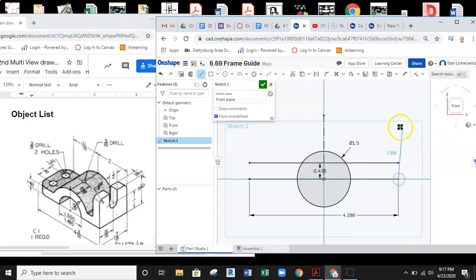Now I can go ahead and start working on the height of this part. So I'm looking at this over here, this height. You're looking at 1 5/8. So we're going to come straight up. Whoop, mouse is moving on me. 1 5/8, so type in 1, again, plus, oh, I can't do that. There's old habits with Inventor. Got to go ahead and just click first, then I got to put a dimension on it. I find that sometimes some of those old habits die hard. So that's 1 plus 5/8, and then hit enter. And that jumps it into position.